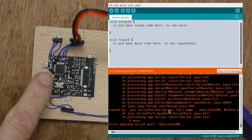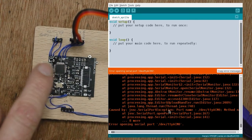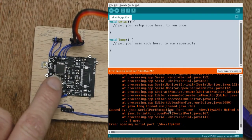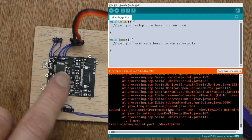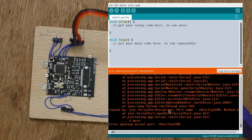Now that's a bit more than just the 4 wires to the processor. It means the power supply is correct. It also means the oscillator's running. Well, maybe. The STM actually falls back to an internal oscillator, but the reset circuit's there, and a few components are wired up okay. So now that I can program it, I can build on this sketch.